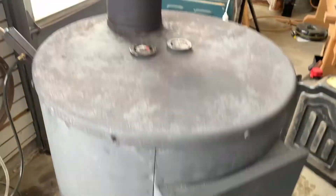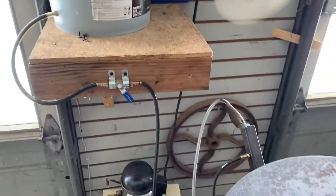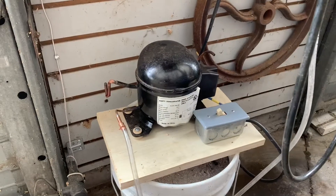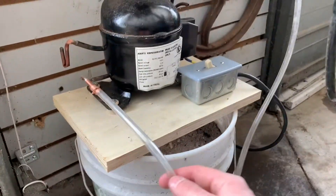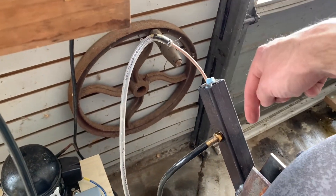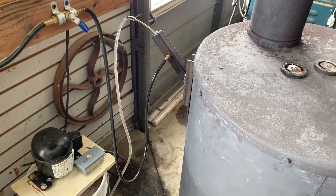The square tubing goes down to about an inch above the dog bowl, where it burns. It needs oxygen to combust, so I've got this old refrigerator compressor. It's wired to a switch, and I just have a piece of rubber tubing that comes out of it. It goes into this piece of copper tubing, which goes all the way down the square tubing. And that provides the air for the combustion.